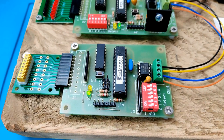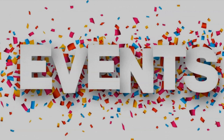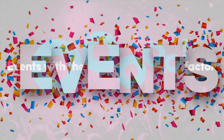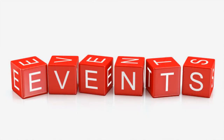How about the CANACE 8C module? We have not done any configuring on that yet. There's not much that can be configured without some extra hardware. The only useful thing we can change is the node number of the module. There are actually two types of accessory control event used in CBUS: long events and short events. Long event numbers include the node number of the module that produces them. Short events do not, or in effect have a node number of zero. Other than that, they work in exactly the same way.